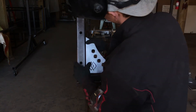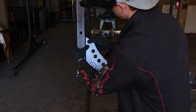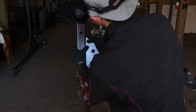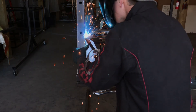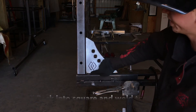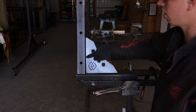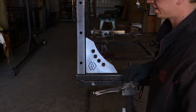I got these ones tacked, and then you're just going to use your gusset to make sure the rack is square with your bed — kind of pull it as you need to until it comes into square. If your saw is set correctly and cuts perfectly at 90, you shouldn't have to move it around too much. After you get your three-position tack, go ahead and do the same on the other side. Don't solid weld until you have both sides tacked, just to make sure the whole rack isn't tweaked. Once both sides are tacked, solid weld all the way around your rack frame — all the way here, all the way down — nothing on the back side.